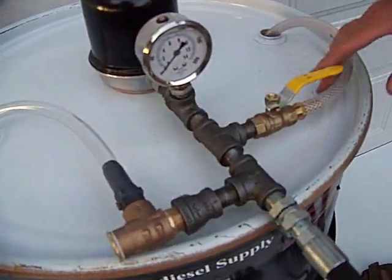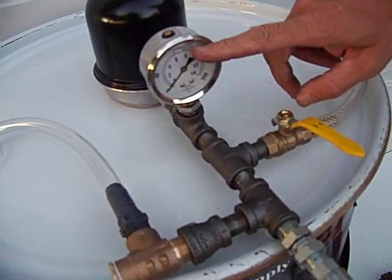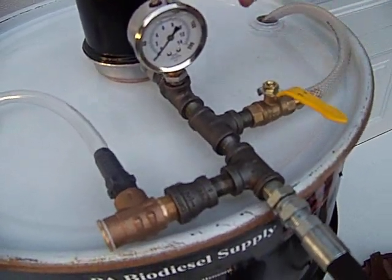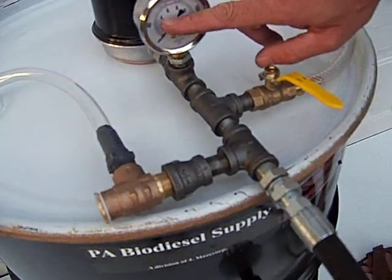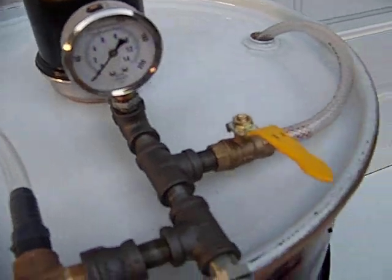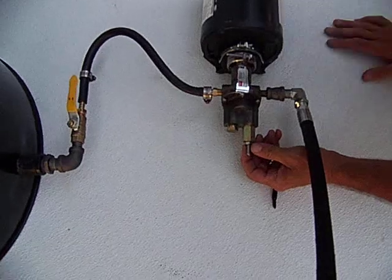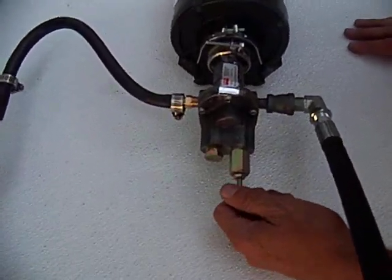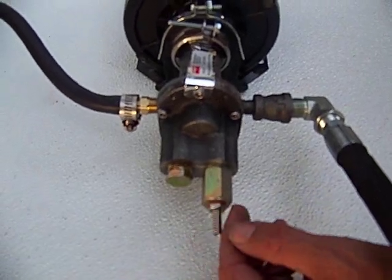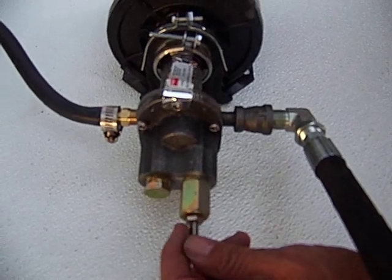Come up here — it's running, it's all bypassing. As I turn this, the pressure gauge goes up. Let's just pretend. It's a brand new pump. SureTech pumps are preset at 50 psi, so on the gauge we'd be at 50 psi. So we come down here to the pump. We move off this black tip. Right here is a lock nut — take the lock nut, loosen. Take a 1/8th inch Allen wrench. I believe it's clockwise, but you can watch your pressure gauge as you turn it, and you can turn this right up to 90 psi.